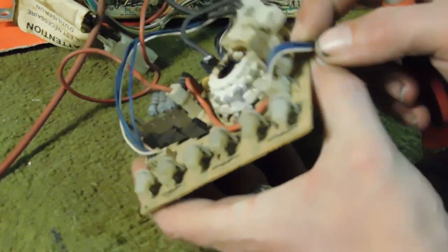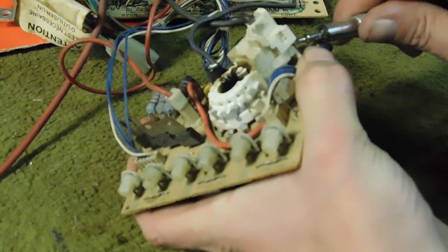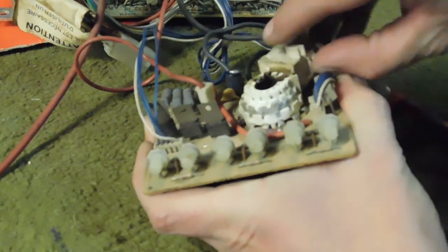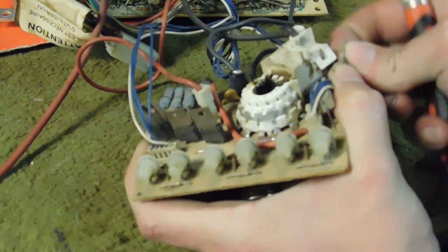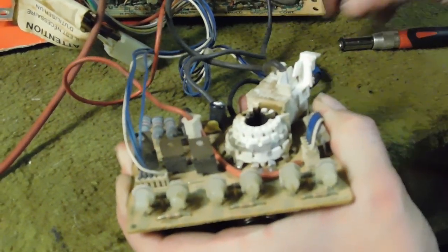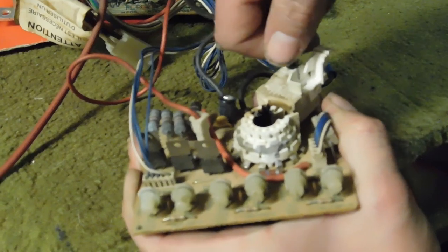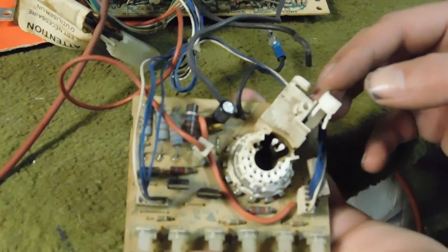What we're going to do is take a flat blade screwdriver and carefully pop this tab. If you had to do it without replacing the socket you'd carefully pop this tab and then this thing will pop up. See — it slides up just like so. It's a locking tab that locks that wire in place. Once you get it open, all you have to do is take this wire and just pull it straight out, and that's it. Now we can go ahead and remove the socket.